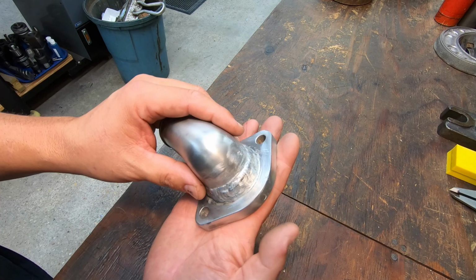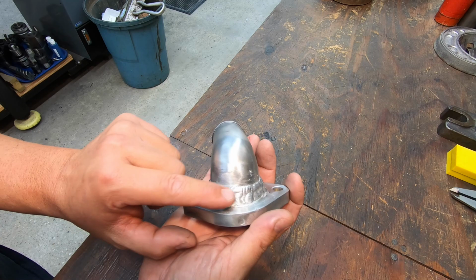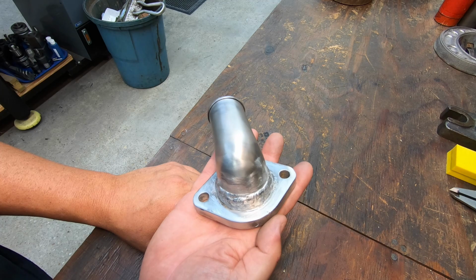Okay, so it's been a while since I've had to mess with any poor quality cast aluminum welding. So, the tips that Joe gave me on keeping the amperage down low and welding short stringer beads, grinding it, welding it, just keeping short beads and keeping the heat out of it, I think that really worked well for me in getting the job completed.